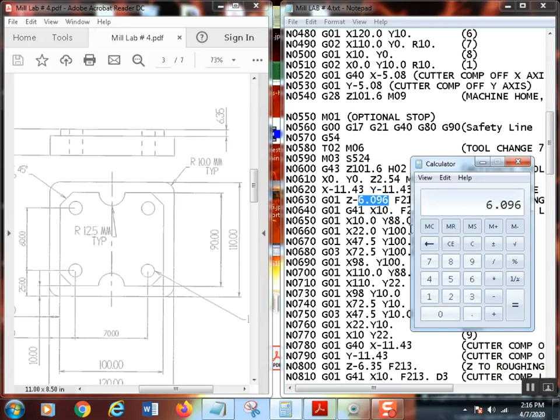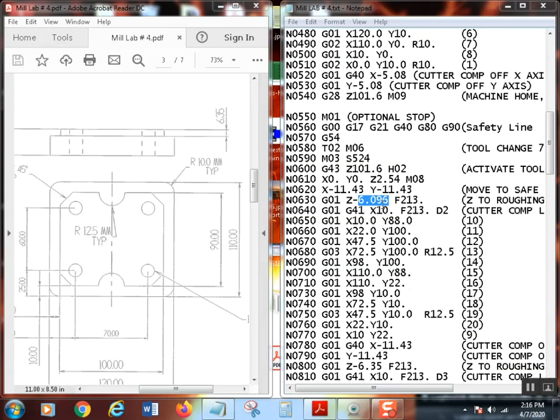It depends. With a 7/8 end mill, I expect very little tool deflection, so 10 thousandths ought to work out just fine. All right. So that's where I've got that there. So I get to my safe start, just like I did before. And we bring Z down. I calculated up my feed. That's what it ended up.